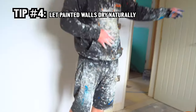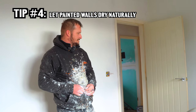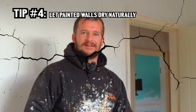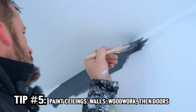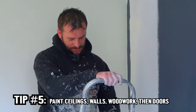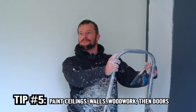I did this second coat on these walls. If you put a heater literally right up next to it, it'll dry too quick and just crack. Always seal first, then do your cutting in on all your walls, roll it all, lacquer your woodwork and satin wood. Never do your ceiling after your walls.